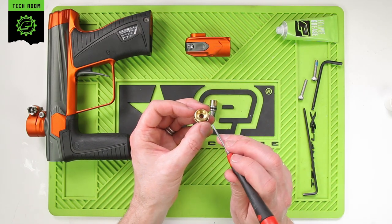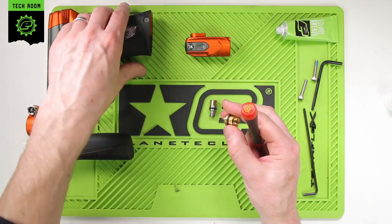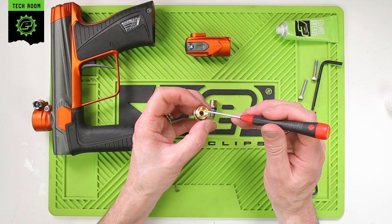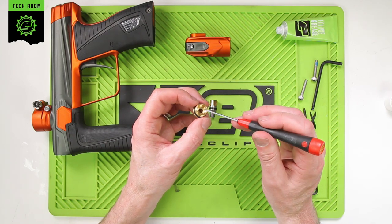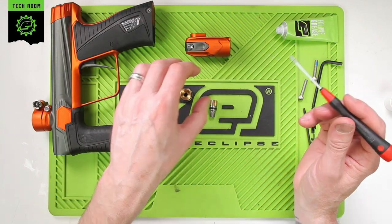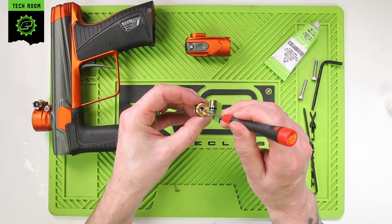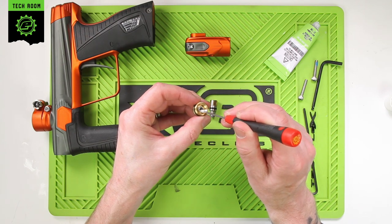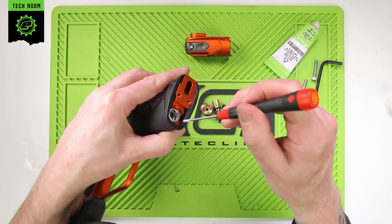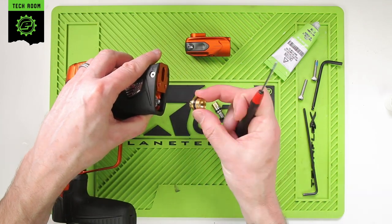The most important seal for greasing is the number eight o-ring, which is on the inside here. This is the o-ring that seals around the stem of the regulator piston. It sees the highest pressure — tank pressure from 450 to 850 psi depending on your tank — so it's very important this o-ring is kept well lubricated. Use a small hex key with some grease on the end, place that onto the number eight and work it around inside there. Make sure that o-ring is well lubricated. Any excess can be placed around the stem and piston as well, when those two parts slide together on reassembly.